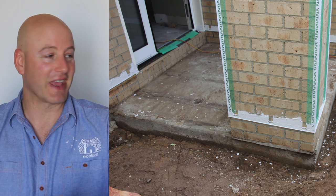In the next photograph you can see the corners again, and how we've dug down to get to the waterproof membrane. You can see the concrete slab just below the bricks. We're going all the way down to the waterproof membrane because we want to seal it and fold it upwards. Then we want to get the land and slope it away from the building — all the water must go away from the building. That was the biggest reason for doing this.